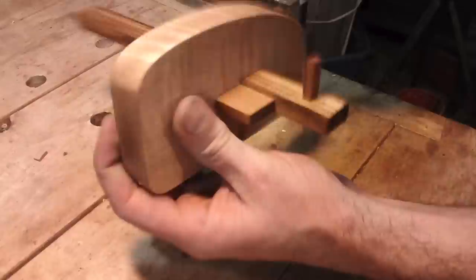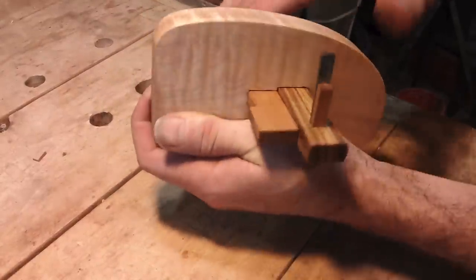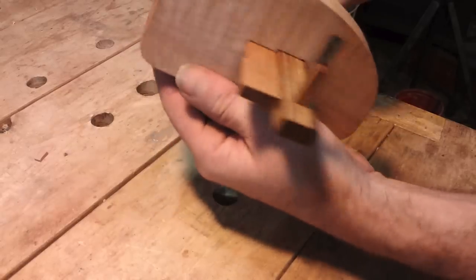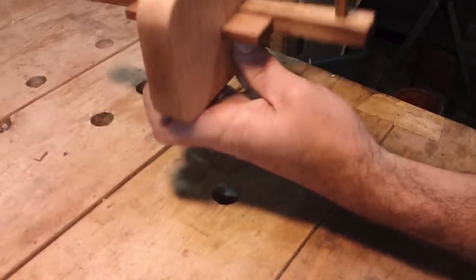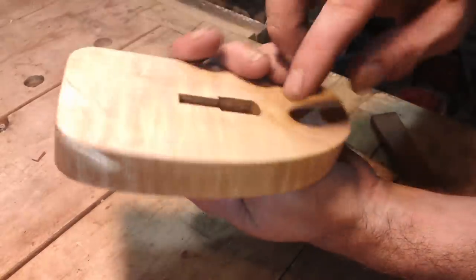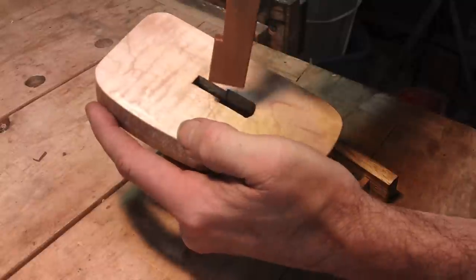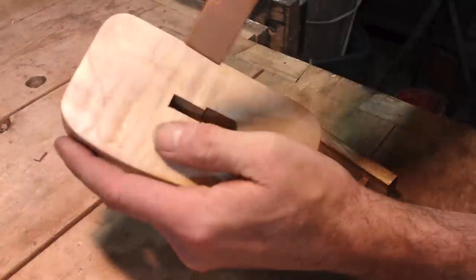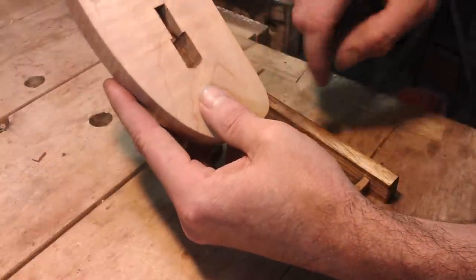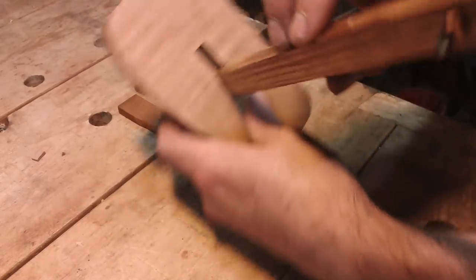This edge is rounded, so as the key is wedged in, it pushes it and it forces it to stay as stable as I can make it. Let's take it apart. Remove that. Key comes out. This is at an angle down, the same angle as the key. So as you apply, hopefully it applies pressure to both sides and it gives you more purchase for the lock. Keep it more stable. It is keyed so that the square end of the rail has a shoulder to sit on.